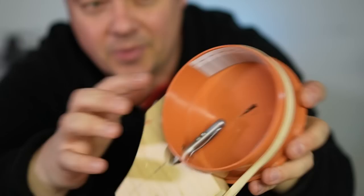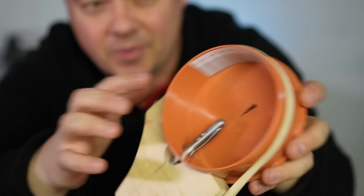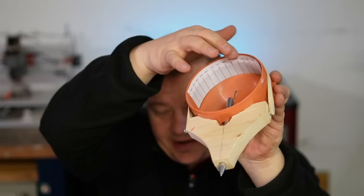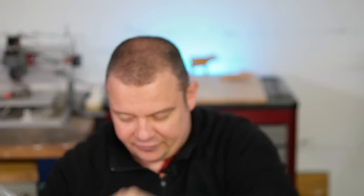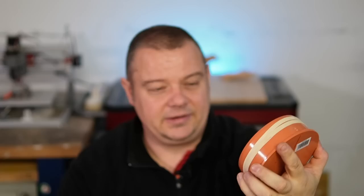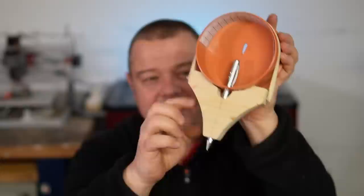This is my second idea for how you can craft a laser goniometer. This one is made from a 125mm sewer pipe end cap and a wooden laser holder. The shape of the laser holder and the scale for the 125mm end cap are available as a PDF file in the description box below. Sadly, I found out that the 125mm standard is more of a Central European thing than an American standard, so you may not find a 125mm end cap. Just work with the end cap you find and adapt the scale and the size of the wooden laser holder accordingly.